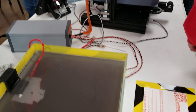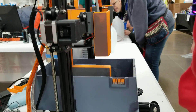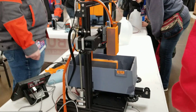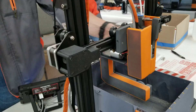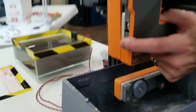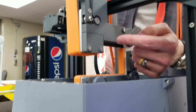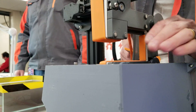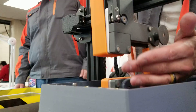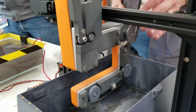On the wire tool itself, you can see there's actually a wire in here. Instead of using a brass rod, we're using a 0.3 millimeter brass wire, held under tension. We have a spool motor on the back that keeps pulling the wire through, and a pinch roller on the front that provides tension. There's a ceramic wire guide that prevents XY translation of the wire axis — you don't want it to wander. It comes around and completes the circuit at the tungsten carbide block, and the waste wire goes onto the waste spool.